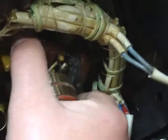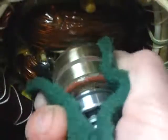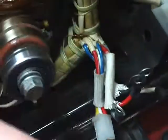That motor has good compression — the motor runs perfect, which is good. Just keep working yourself around there, and if you see a bad spot, go for it. Buff your slip rings while you have it apart and you'll save your brushes.